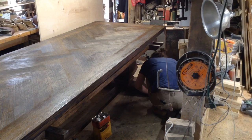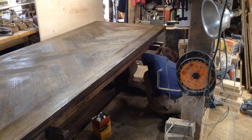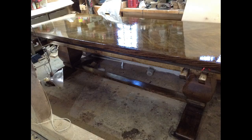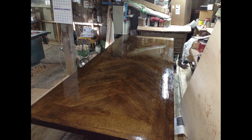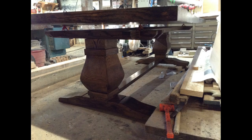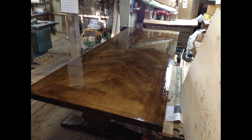I usually sand a lot between coats, but because I put stain, I put a little stain in the first coat — you can do that with Waterlox. I've had some problems with Waterlox because there's mineral spirits in it kind of lifting the stain, so for that first coat I put a little stain in there. I only lightly sanded between all these coats and it's actually turning out pretty good with just that light sanding. This has just been painted so it looks like a high gloss, but this will dry to a semi-gloss finish. And that's basically what it looked like at the end of today. If I get some photos at the customer's house, I'll update the thumbnail on the videos.